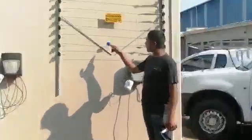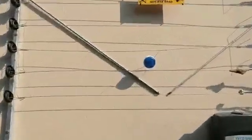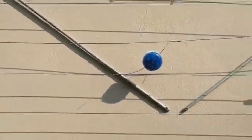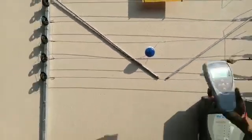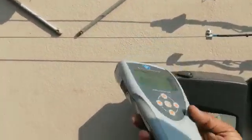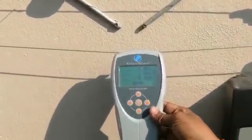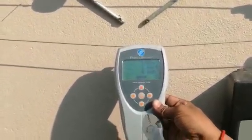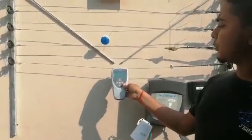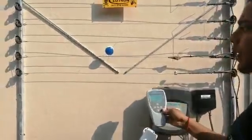You can see that the fence is on — this light indicates the fence is on. I'm going to grab a fence scope meter, which you can purchase from us. It shows you how to measure your fence. I'm measuring off the live wire and it's showing me 1.5 kV peak and 7 amps current. The reason for the 1.5 kV being low at this point is there are no earth spikes in the ground.